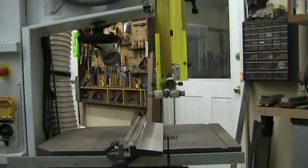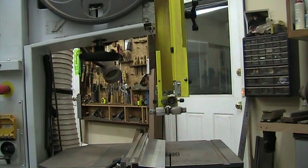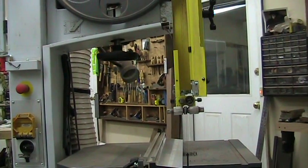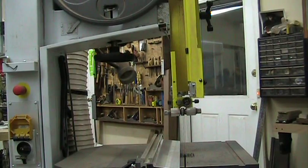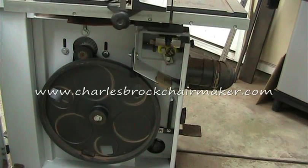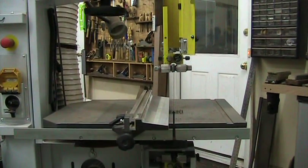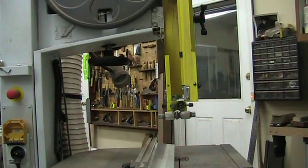I've got the door open right now. There is a little folding door that folds up and covers the blade — it's kind of a blade guard, which is very, very important. You open that door and then you loosen the tension on the wheel itself with that big black knob there in the middle, and then the blade will come off of the wheels. You pull it off and fold it up, which if you don't know how to fold a bandsaw blade yet, can be rather dangerous. In another installment of Maloof Inspired Rocking Chairs, I'll show you how to fold up a bandsaw blade.